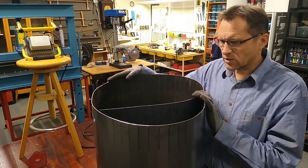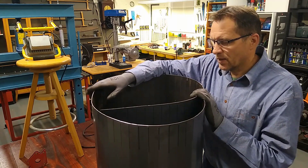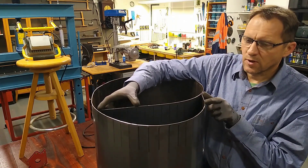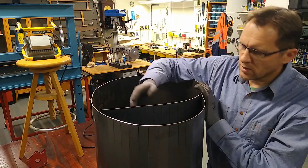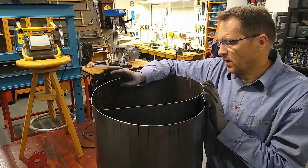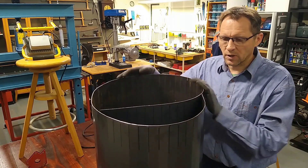Well, to be honest that's not looking too good. This is not the cylinder I was hoping for. So I've taken it out of the press brake because it was becoming increasingly difficult to feed it in. The 100mm surface I allowed for at each end is getting in the way, so I'll cut that off. I'll put it back in the press brake - I've still got a few bends remaining. Once I've done that I'll clamp it in the press brake and try to open up the radius a bit and see how that goes, hoping to get it back into shape.